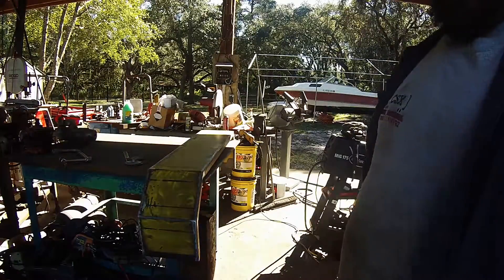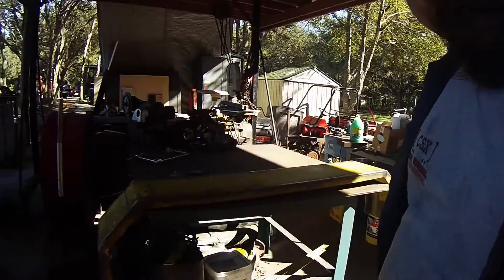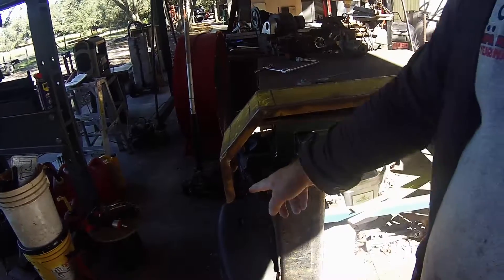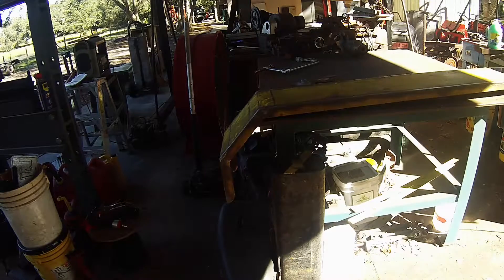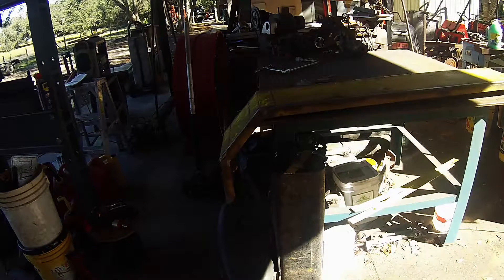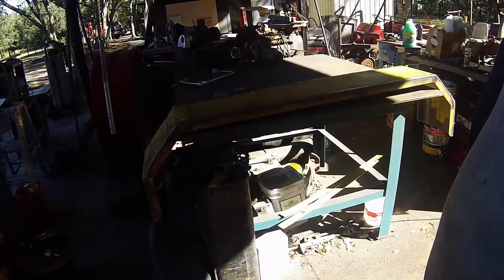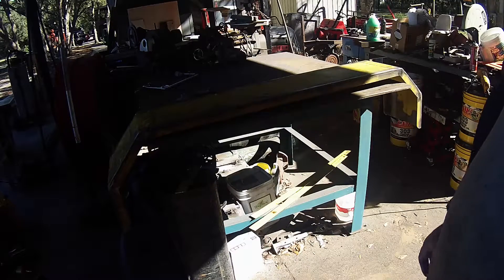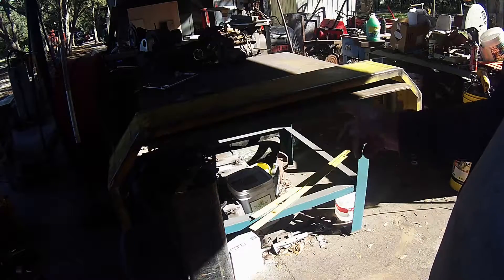Just finished this fender. Just ground it up, got it all cleaned up, went over it with a wire wheel. Got the bottom corners all ground - kind of like a little roll around there so they're not a sharp corner. This one's done now. And now I can put them on the trailer. I'm not going to show putting them on the trailer - it's straightforward. Obviously: cut the old ones off, get this to fit, and weld them on.